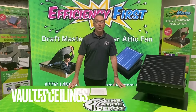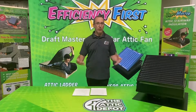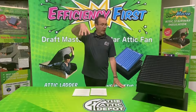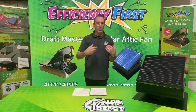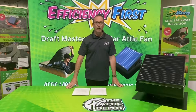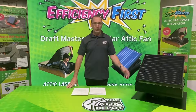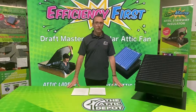When getting ready to install your solar fan, make sure it's not placed over a vaulted ceiling. You want it clear of any obstructions. Normally we'll go into the attic and take a look around. Make sure the fan is going in place of a turbine or an air hog vent — that way you can just remove that vent and replace it with the solar fan. If you're going to cut a new hole, make sure it's free of obstructions, as you may have ductwork or wiring running through the attic. Definitely don't want to cut through a duct or electrical wiring.